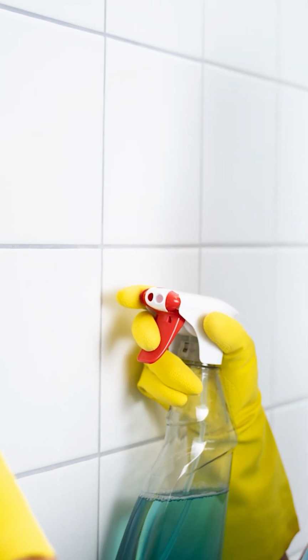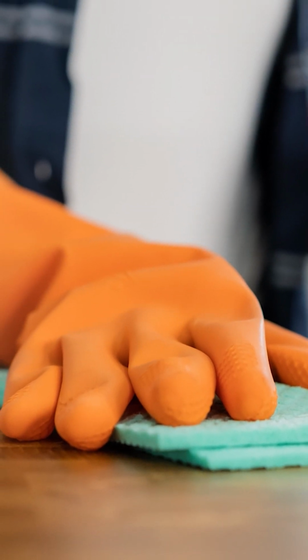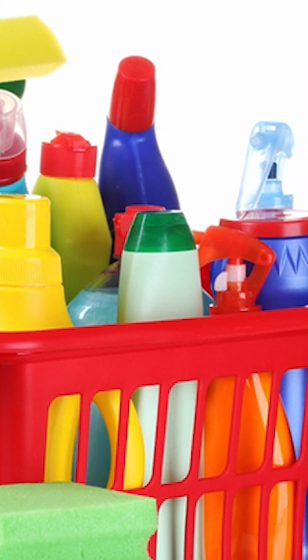Here are a few additional products and techniques for cleaning specific surfaces. Many times, varnished or lacquered wood is protected with a polish like Pledge. While products like this can be used to clean the surface, they also can leave a thin layer that does not react well with vinyl adhesives. We suggest you use some sort of grease-cutting solution to ensure you're clean down to the sealant.